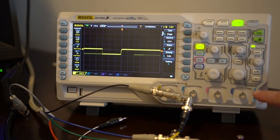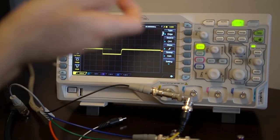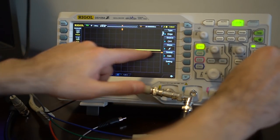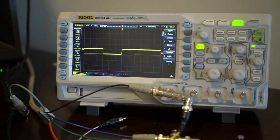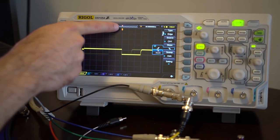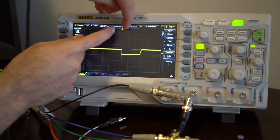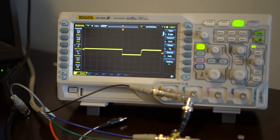Going back to my basic understanding: even though you hit this menu, you still use this dial to change settings — this is the universal selection wheel. This other knob is only used for the trigger level. So you want to set your trigger level where there's an edge on the sync pattern — this is your edge polarity, that's what the slope is. Typically for video the first standard is falling edge. You set your level where you want it to trigger, and it centers around this T marker here — that's where the scope is starting in time.